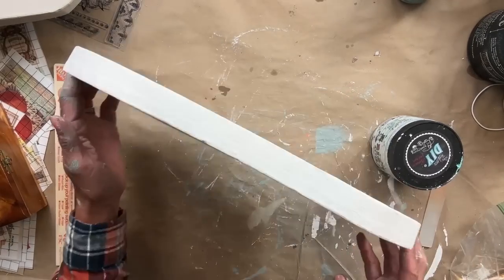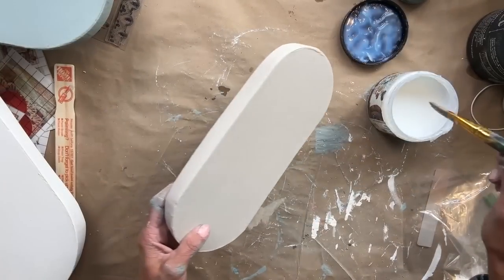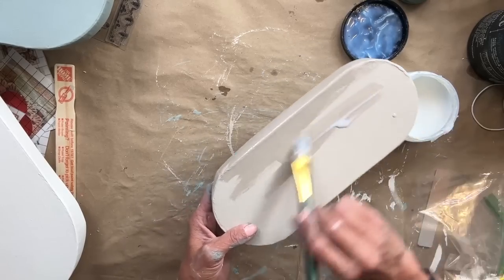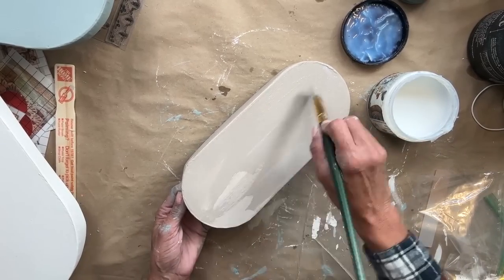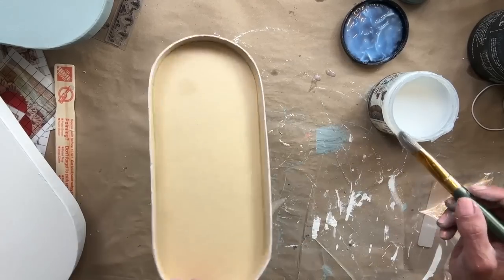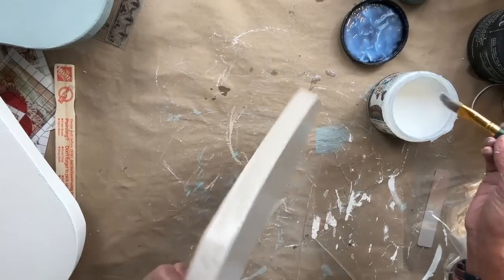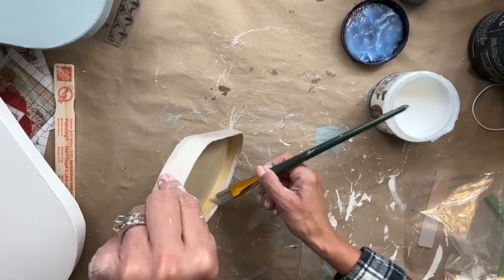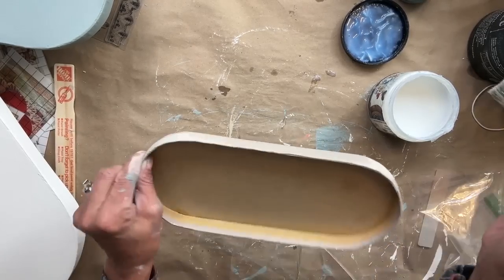Lastly, you do want to seal your project. Anytime you're using a transfer, you want to seal that. Because I'm using DIY paint, which can be reactivated with water, you do want to seal it with some type of top coat — whether that be Big Top like I'm using here, a poly, or any type of wax. DIY paint can be reactivated with water, which makes it awesome for blending, but yes, you definitely want to seal it. That is a question I hear so often, so on all my videos I always remind whoever is watching what needs to be done.